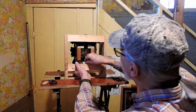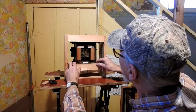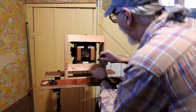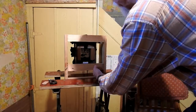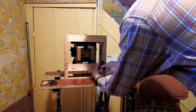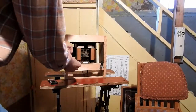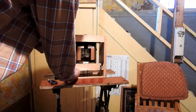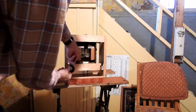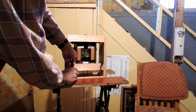Once you get your stand made, you've got your clock hanging there — now you want it level. I actually got this little level with the clock cleaning kit that I purchased, and you adjust it until it's level. What I do is cut a couple shims to put on the back side. Put one on one side and snug one on the other side, then tighten her down.